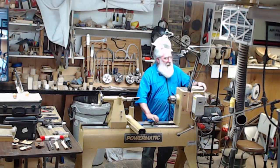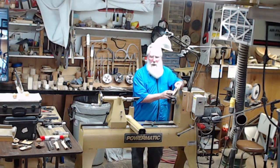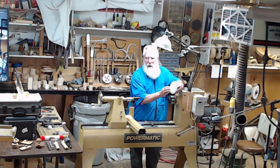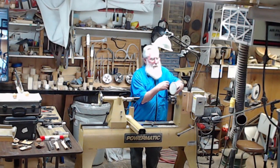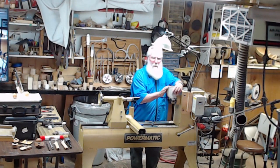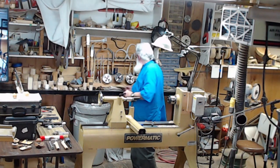The sanding disc that he was thinking of stealing is made out of MDF board and PSA pressure sensitive adhesive, five-inch discs, and you peel it off and put another one on. Also, I do some carving on some of the MDF. I'll put compound on here, and I can actually take my carving tools and sharpen them up on here. It works pretty well.